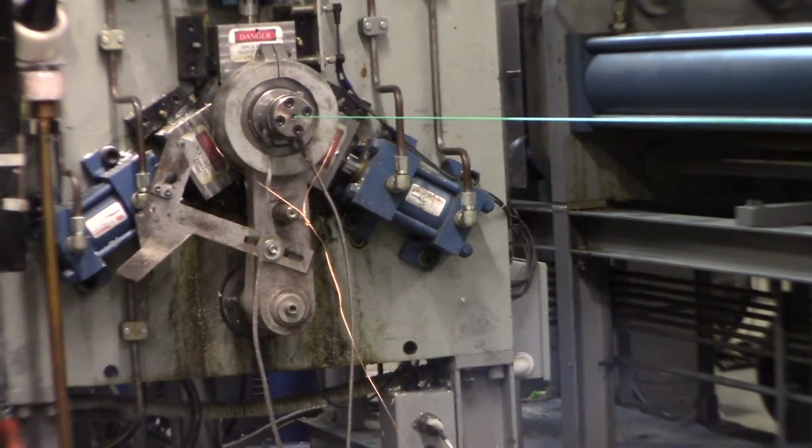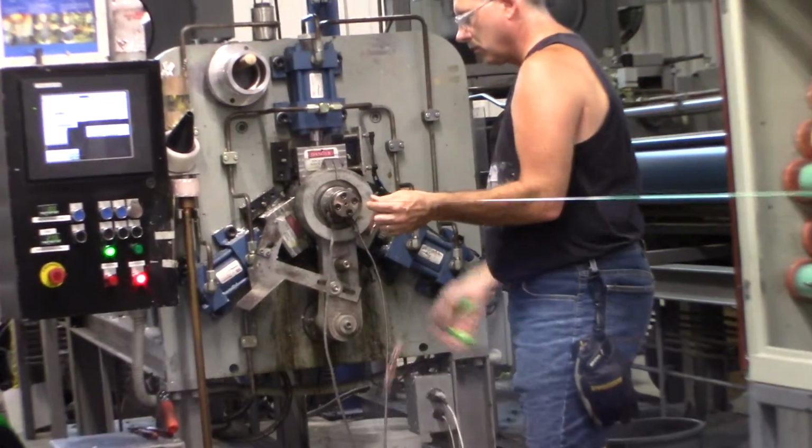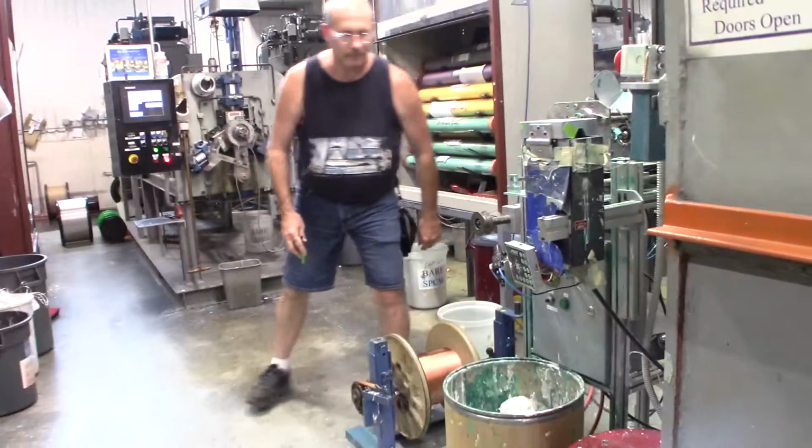Harbour Industry's goal in this project is to automate the joining of a copper tagline to the end of a silver-plated copper wire after a process coats that wire in a PTFE insulation. Currently, that tie-in is done by an operator manually. There is a risk to that in terms of the operator's safety for getting caught in the wire and in the join, and it also requires that the wire be slowed down significantly in order for the operator to be able to handle it.